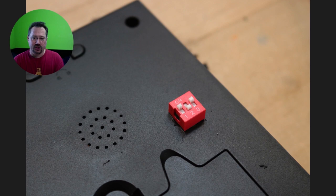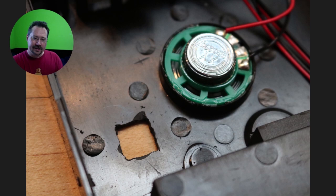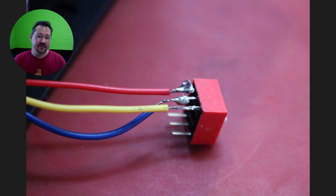So when I did get my switch — a dip switch with three individual switches — I put it in that small hole and then traced around it. I just scratched with an exacto knife to make a mark, and then I took the Dremel with a cutting tool and squared it off. I used a three-eighths inch diameter drill to make the hole since that was about how big this was as a circle, and then just squared off the corners. From the inside it doesn't look great, but it's the inside, not the outside.